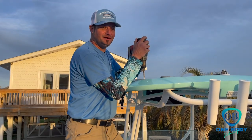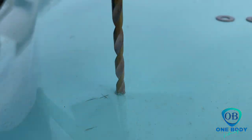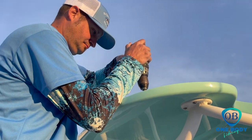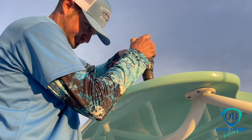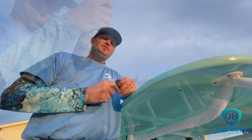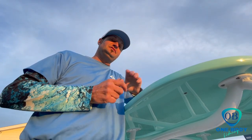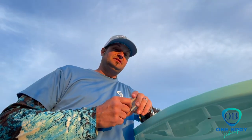When drilling in the fiberglass, what I like to do first is drill in reverse so there's no chipping or cracking. Now that we've got our hole drilled into place, we're going to take a rubber washer and place it on there. The reason we're using a rubber washer is to create friction to keep our rod holder from spinning around and to protect our T-top.